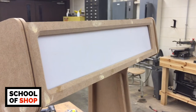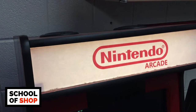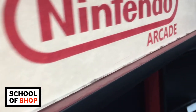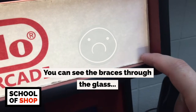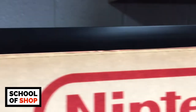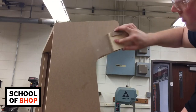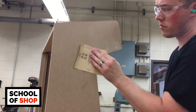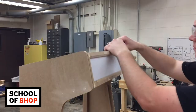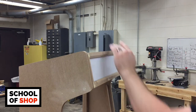In a minute I'm going to use the same technique for making the frame on the monitor. Here I wanted you to take a look at the marquee of an older arcade I made so you can see why I did it differently this time. By making a frame, you can cover up the edges of your plexiglass, which could look jagged and unprofessional. Next, sand away the wood filler on your nail holes to give it a nice smooth finish. You can see in this shot that I put some white plexiglass into the marquee just so I could see what it was going to look like, and it looked really good.